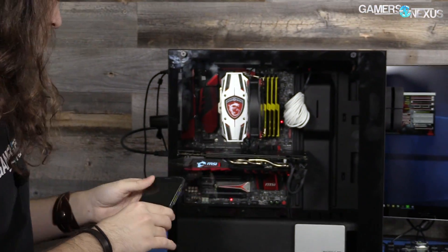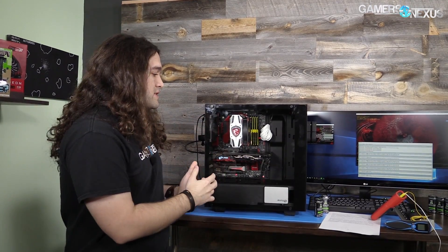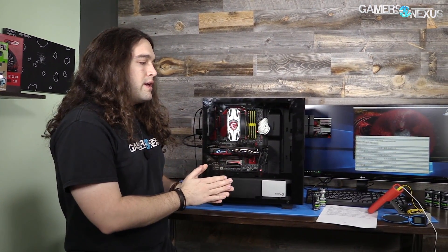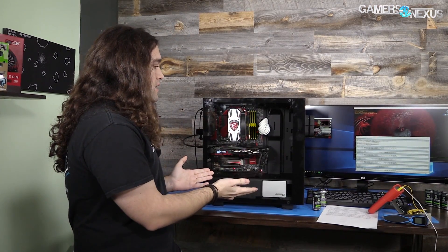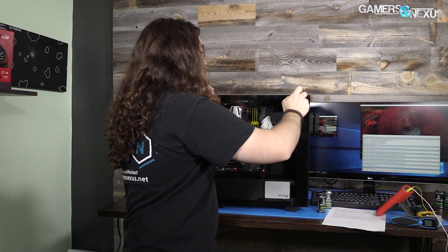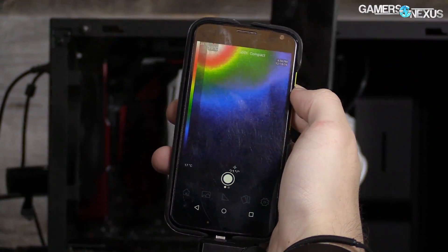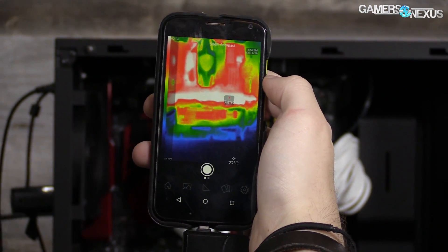This is part of knowing the emissivity of the object under test. If you don't understand the emissivity — the emission index — it's a 0 to 1.0 scale. Ideally you have something like a painted black piece of steel, which would be what's called an ideal black body in physics for measuring temperature. This glass is not that. So let's remove this panel — you can see my hand holding it up — and see how things change.